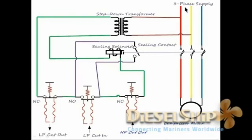We have a three-phase 440 volt supply, which is R, Y, and B. Through the direct online circuit breaker it goes to the stator of the induction motor, and we are taking any two-phase connection and connecting it to a step-down transformer. We don't require 440 volt supply for the control circuit, so we step it down to either 220 or 110 depending on the manufacturer through a step-down transformer. Let's now understand this control circuit, then it will be very easy to understand the operation.